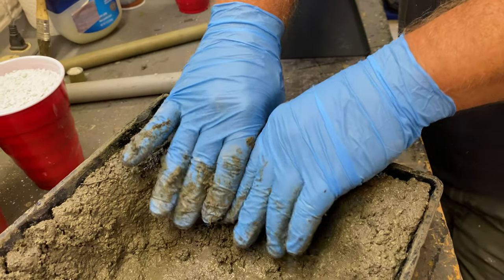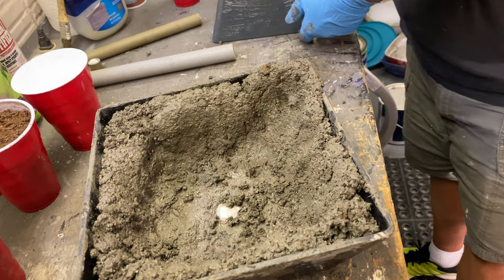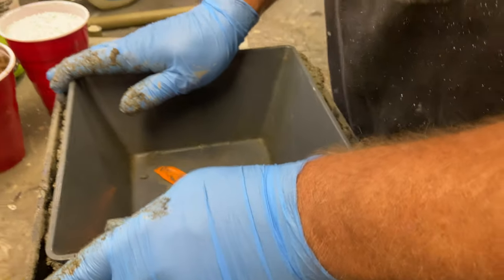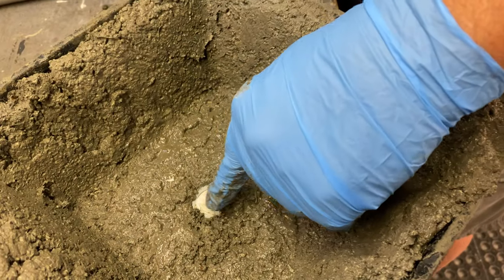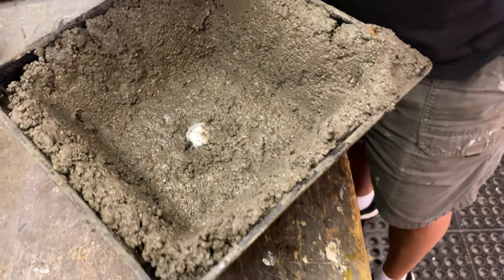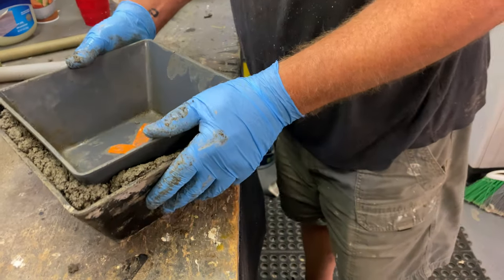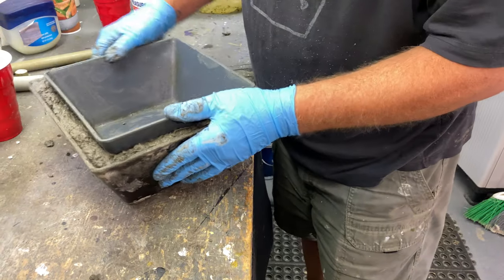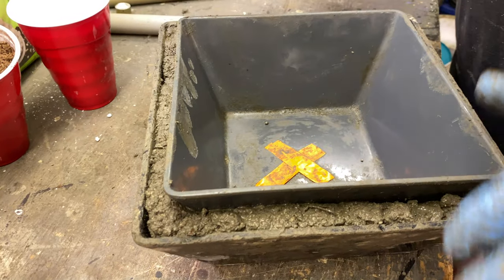You can see that mix took about two quarts of water. If you're curious about the water, it took about two quarts. Now I'm going to take the inside of the mold and we're just going to push that down. I can remove it for a second so I can get an idea of how close I am — and I'm real close to the plastic pipe. So I'm just going to pop that down there a little bit more. Now I'm going to make some noise again because I am going to pound this down with the form inside of the form. Now you can see some low spots as we push this down, so I'm going to go through with my hand and just add a little bit more along the sides, and then we'll pop it down one more time and this pot will be done.